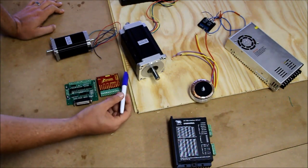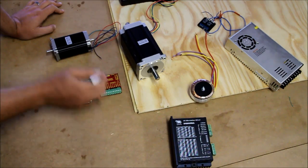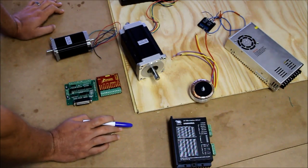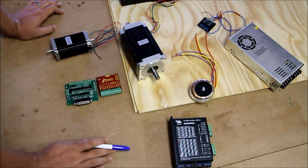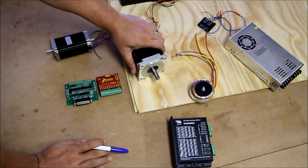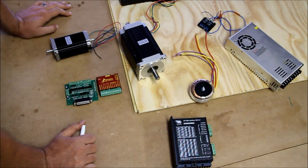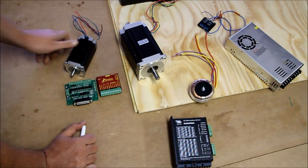The chart says at 36k it will give 3 amps, so I would put a 36k resistor on this for the 3-amp motor. Because this other motor is 3.5 amps, I always believe more power is better, so I go for a 65k resistor which gives 4 amps — that will drive this motor quite well without overheating. If you run 7 amps into these motors they will get very hot and can be damaged. Drive the motors within their tolerance and spec.